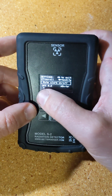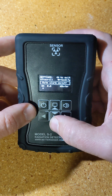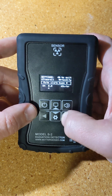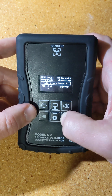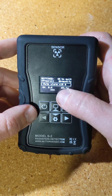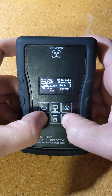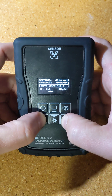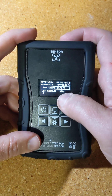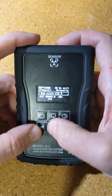Back to the top: rate alarm on or off — there's a little arrow pointing to the current setting. I'll put the rate alarm on to show how it works. Going down to the next option is the base number, which changes the leading digit 1 through 9 — so 0.6, 0.7, 0.8, 0.9, then back around. Down one more changes the X10 number, meaning it adds or removes a zero to set the rate alarm to whatever level you want. I'll leave it at 0.6 so I can trigger it easily with the check source. For the dose alarm it's the same, but in microsieverts instead of microsieverts per hour — you can turn it on or off and set the base and X10 numbers, then back to the smoothing setting.